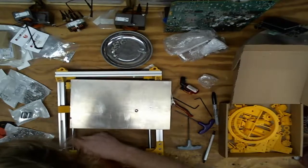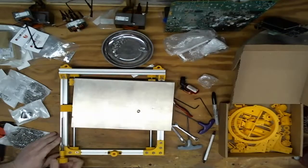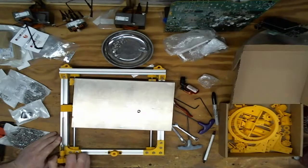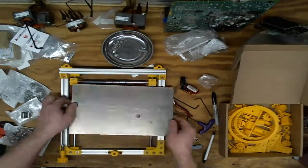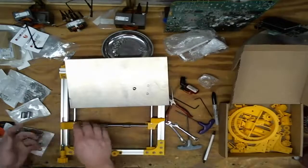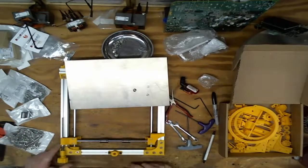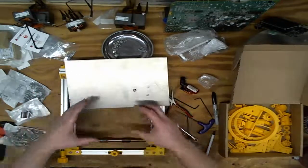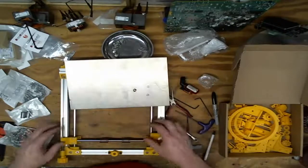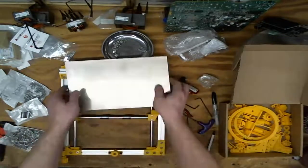To compress that spring a bit and lock those two nuts together like so. So now this still turns freely, but it pulls everything that way, so when you adjust it there's no back and forth slop. And if everything worked out and I got this assembled correct, it slides right on, slides the whole way. The downside of doing this is I lost that much travel, but in theory you should be able to move the magnetic mounts around to get you close, and this is just to get the final adjustment. So three pieces left.